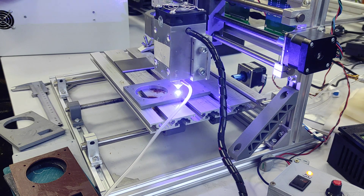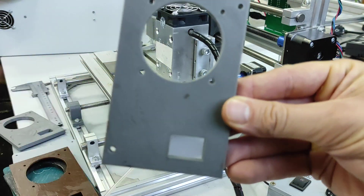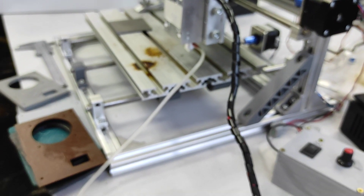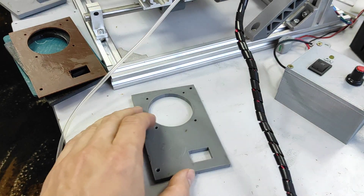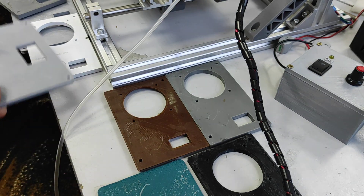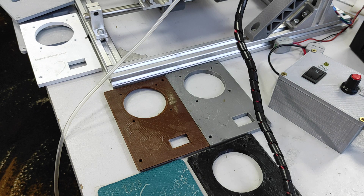As you can see, all types of plastics require their own settings — it's like 3D printing where all plastics are different. But you can do really nice laser engravings with a diode 10 watt invincible or deluxe laser. You need an air assist for this engraving, and I'd recommend using our dynamic PWM system so you can adjust power without spending extra time generating G-code — it's very comfortable and convenient. Hope you like this video — please share it with your friends, have a wonderful experience with Endurance Lasers, and don't forget to visit our website endurance-lasers.com. All comments under this video are more than welcome — bye bye!